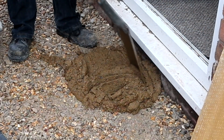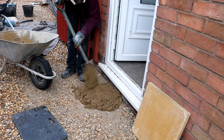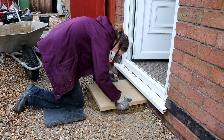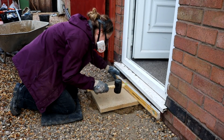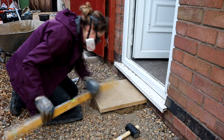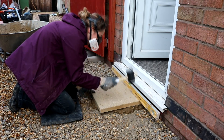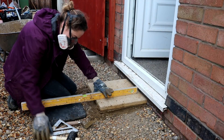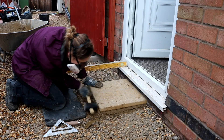I started off with a centre slab - just shoved the mortar on the sub base. Bear in mind there's weed control fabric under this as well. Then I placed the slab on top and using a mallet and a spirit level I made sure it was level from left to right, malleting it in the centre so any mortar would spread around. Holding the spirit level sideways I made sure the slabs had a two to three millimetre slope, meaning my spirit level bubble was just off, so if it rained water would fall straight off rather than running towards the house.